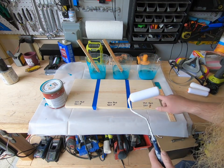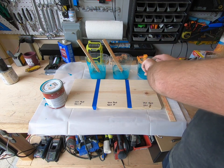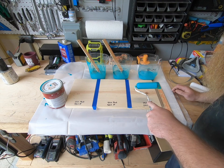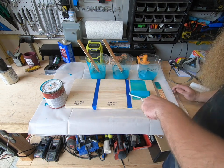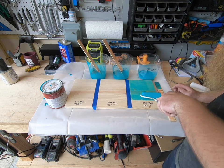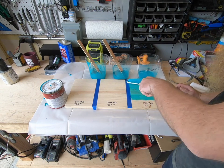Starting with 75% water and 25% paint. Our end goal is to see the veining and the wood details come through, so I think this lightest mix is probably going to be the best. You can definitely see the wood is coming through — that's good. But it could probably be a little darker; this is a little watery.